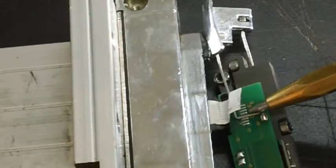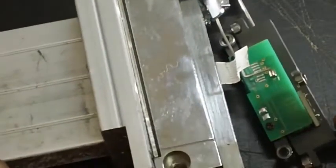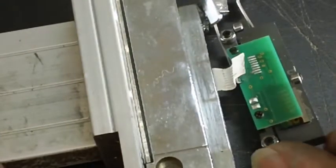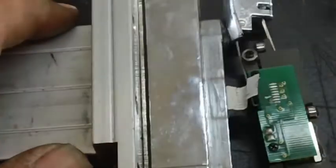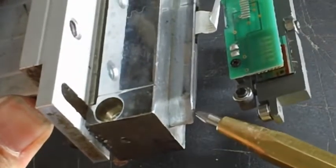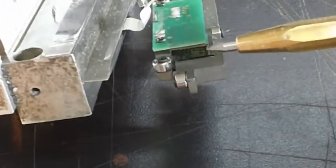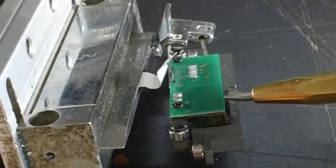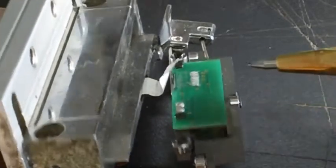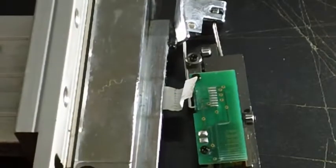When the thing canted and broke, it actually pulled this ribbon cable here from these contacts — and that's a pretty easy fix to splice back and re-solder. This part right here keeps it inside the track on the back end, and then there's supposed to be a piece of metal on the front end to keep it aligned inside the track so it can't come in and out. This is the reader head that actually spans the glass — you can see the actual reader inside of there. The glass slides along inside, and it's got roller bearings on the bottom, top, and sides that allow it to track along the glass evenly.